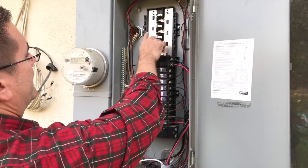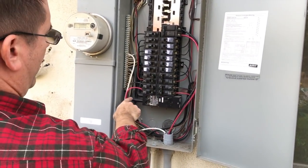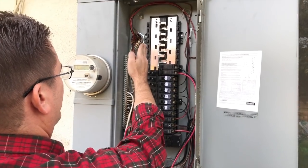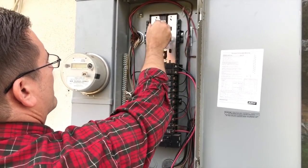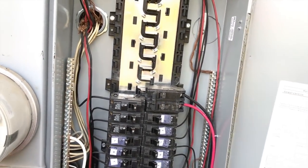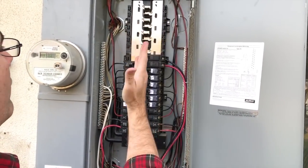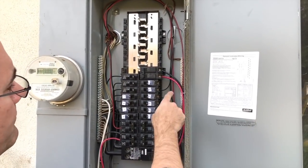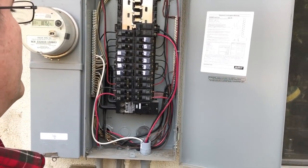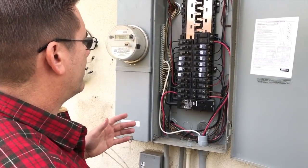What's the difference between a double-pole and a single-pole? You can see how these bars are organized. Remember on the drawing how I said there are actually two hot wires coming into the panel? One wire powers this side, one wire powers this side. The circuit breaker plugs into that tab. By having two breakers side by side, you're taking 120 volts from one side and 120 from the other — so going to air conditioning or the dryer, you actually have two hot lines going in there. The transfer switch can do double-pole circuits, but I'm not going to power any of mine that way.